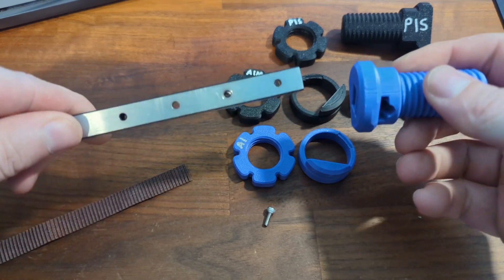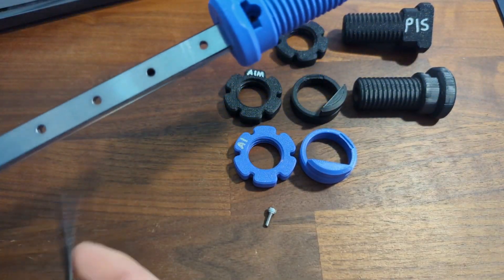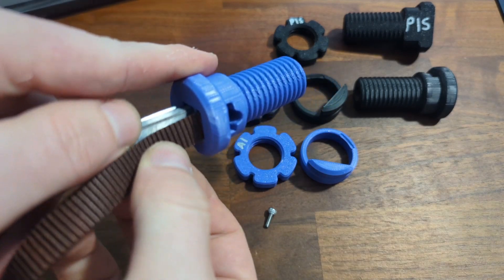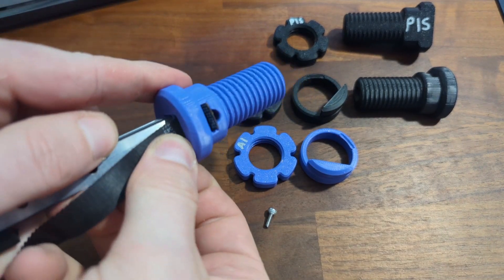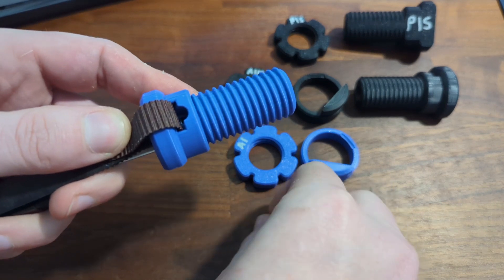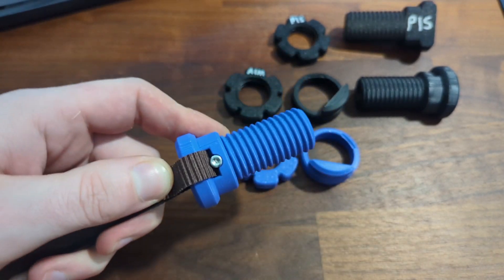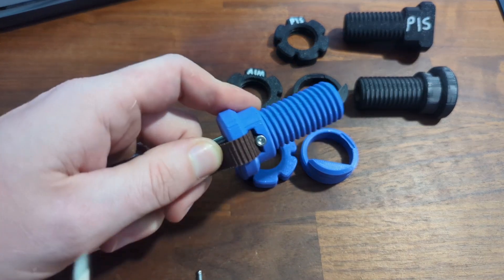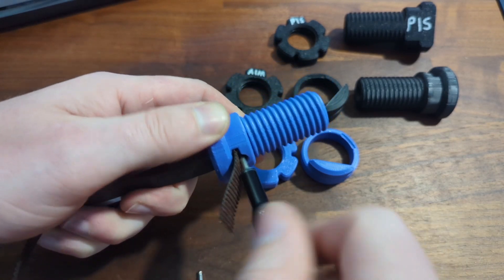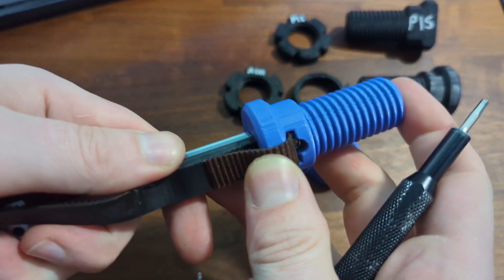There's an access hole on this side, so that goes opposite of the nut — slides in here. While that's in place there's a barrier that's printed in here. You slide the thing in and just push, and it curls it around. Then you get your M3-8 and you can drop it in here, switch into an easier tool, and it goes in. When everything is aligned it will thread into the nut on the other side.